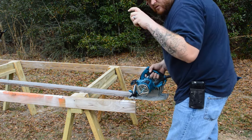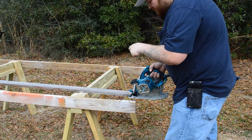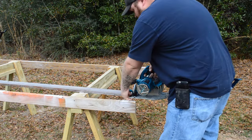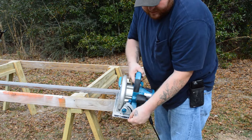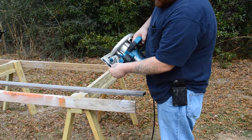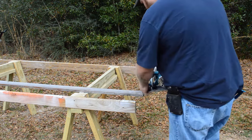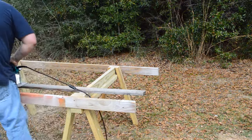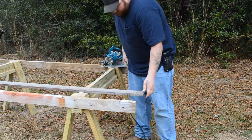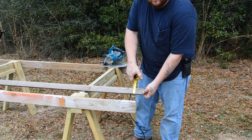You're going to pinch your blade base and slide your finger along that board. See how I'm pinching right here? That's my two inch mark. So when I slide it, the board slides right along my finger — just like that, a two inch board.